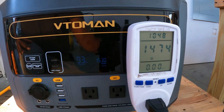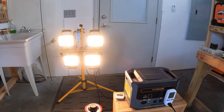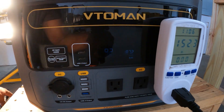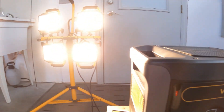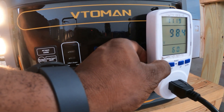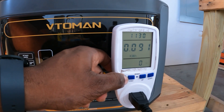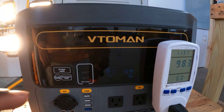We're at 1500 watts — the monitor reads about 1530. It can hold its 1500 watt rated load comfortably. Let's see where it starts to limit. At around 1800 to 2000 watts, that hits the rated limit of the inverter. It starts lowering the voltage — down to about 98 volts — so it can hold the load rather than shutting off.